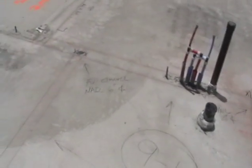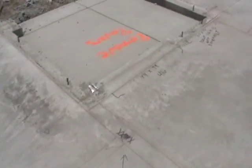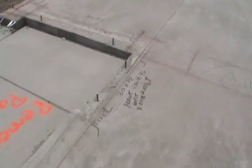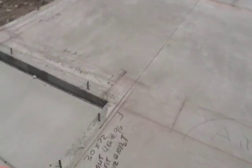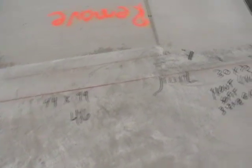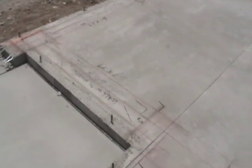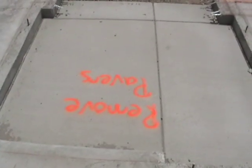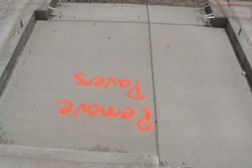One of the main things that is going to be indicated on the slab is going to be the rough openings and their measurements. A rough opening is an opening for a door or a window, and it's going to be slightly larger than the door or window that's going in. Here we have the front door, a side light, and also a wall with the window going out to the entryway. That extra space in the rough opening gives the trim carpenter the opportunity to make any adjustments to make sure that the door or the window is plumb and square.